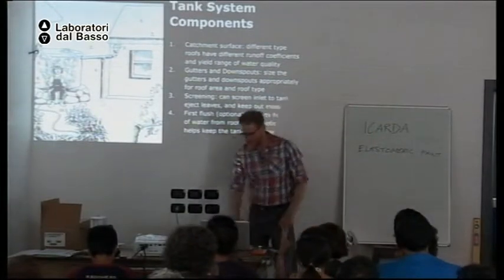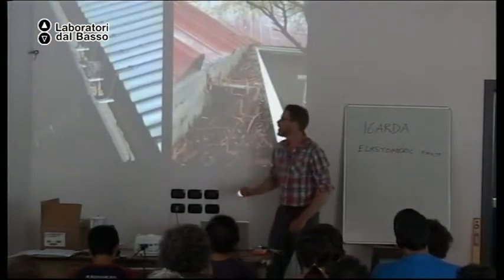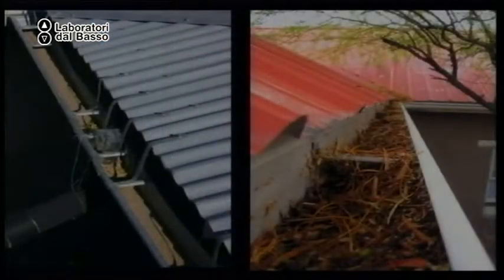All right. And we'll look at some other options. So, okay. For the gutter screen, sometimes people have a screen over the whole gutter, or here, just a screen at the downspout opening. I don't like this so much because I typically cannot see what's in the gutter. I don't know if the gutter screen is full or not. And it's difficult for me to get to it and to clean it out. So I typically don't like the gutter screens.